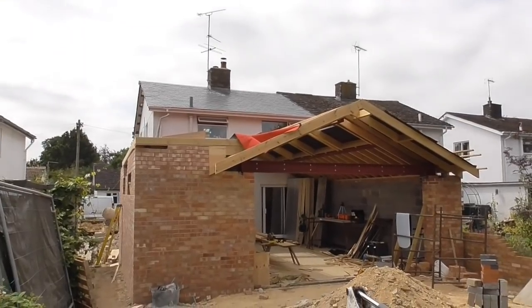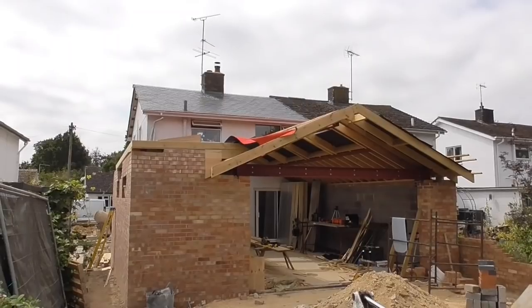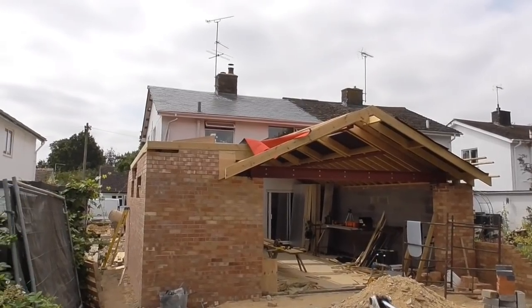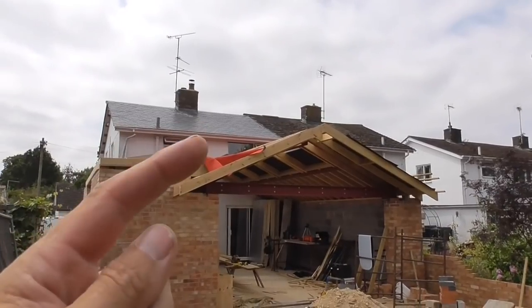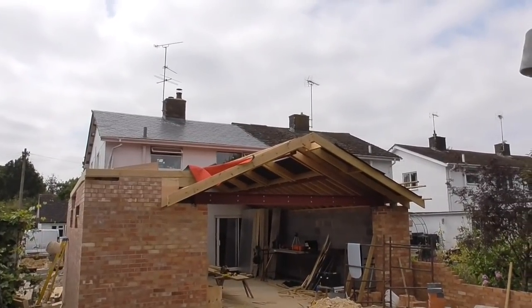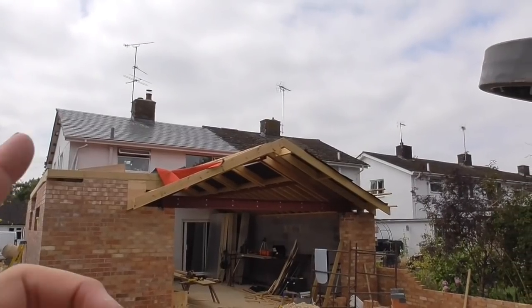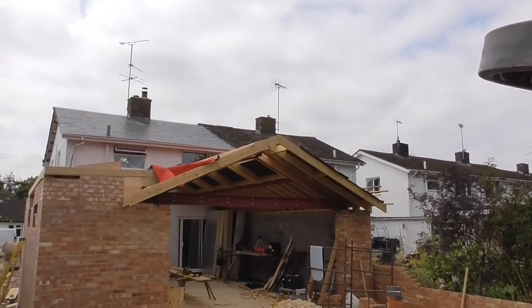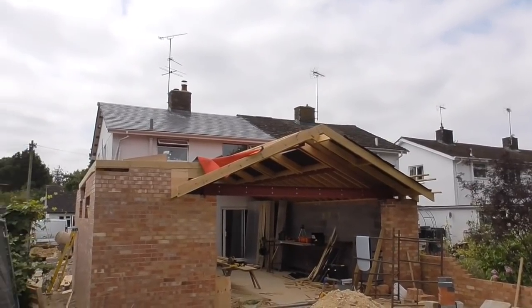So I think they've got to wait for the roofer to come in. He's going to do the flat roof section first. He'll put the fascias round, and then he'll felt and batten it, and he'll leave his undercloaking over far enough on this barge detail so that the customer can then decide what exactly they want on that barge. I think they're going to go for something nice, as I said earlier, but all of that can be done secondary.